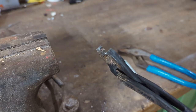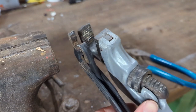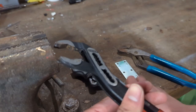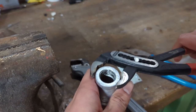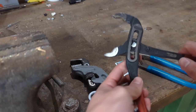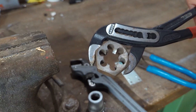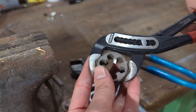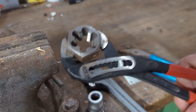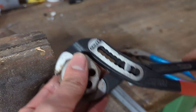The jaws here are far thinner than any other pipe wrench. So I have this pair of pliers and this rigid pipe wrench — it's much thinner, so it fits in tighter spots than a pipe wrench and is more versatile. The self-locking feature doesn't just apply to round parts. Here I have this hexagonal threading die; it's used for cleaning up threads on larger bolts, and you can grab it with this pair of pliers. This is no replacement for a proper sized wrench, but for miscellaneous grabbing purposes, it works well.